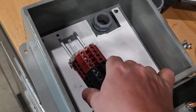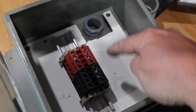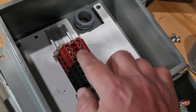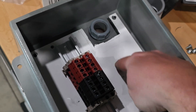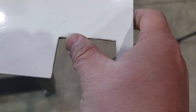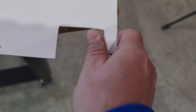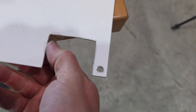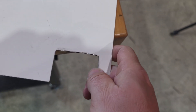Without the back plate, when I put the din rail in it's going to put bolts through the back side of the box and we can't have that. All your electric is coming in from your solar panels and going out to your combiner box here, so I need to create a solution to come in from the back side without the plate being in my way. I got this thing very smooth — you can run your finger on it with pressure and there's no way it's going to cut a wire. I took a file to it, sanded it down, and beveled the edges.